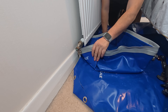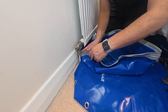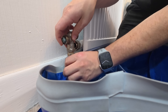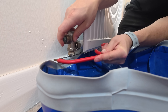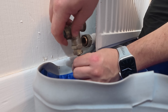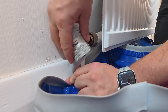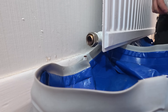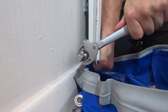I'm going to shift this mat back a little bit and get the tub all the way around that valve — that should give me better access to take the valve off. Because we've got a nice little bit of play, I'm going to go ahead and cut it with a hacksaw straight underneath as we're going to be soldering it anyway. Let's start taking this tail off — I've got a little spigot from a Rothenberger set as I don't like carrying the whole spanner set.